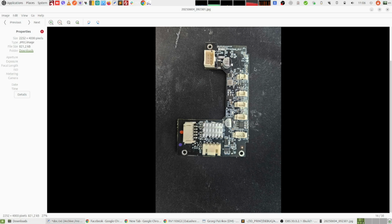And what I did was I disconnected the cable on both sides. I measured the resistance of the cable, I wiggled it around to make sure that there are no breaks when it moves. I also traced the cables from the connections on the boards to the other connection on the board to make sure it's not something that is disconnecting here on the connector side, and everything looked good. So this ruled out the theory that there is something wrong with the cable itself. So now I was left with two theories.